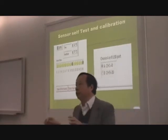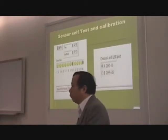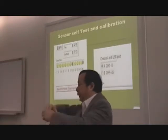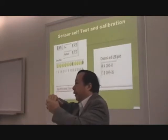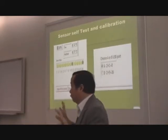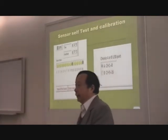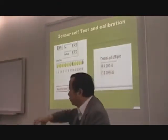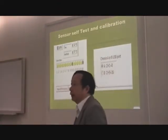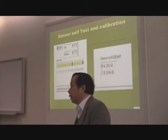One thing I must explain, fiber optics is not like electrical. They have some weakness. The weakness is that you cannot bend it into a sharp angle. You cannot make a right angle turn. But most of the engineers working on electrical stuff like to be neat. Sometimes they bend the cables in a bundle and then it's tight. And we didn't emphasize it enough.